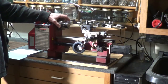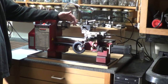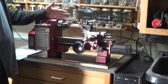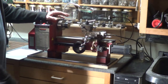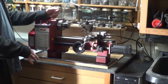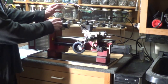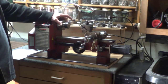The ER32 system — I can't tell you how many times I've made something threaded for a screw, flipped it around, and found a collet that fits the threads without damaging them, clamped down on it. Some other part I've already machined I've got to flip around to face the other side — I'll find a collet. I've got every imperial and every metric collet off eBay, and it was only a couple hundred bucks for the collet set.